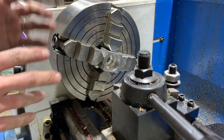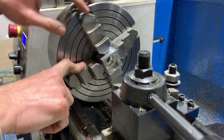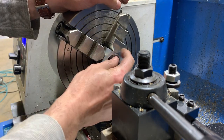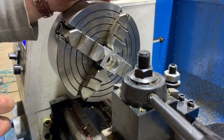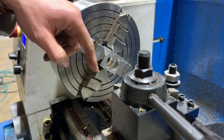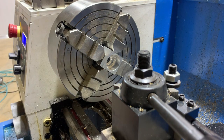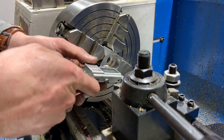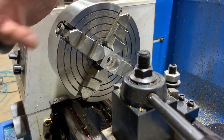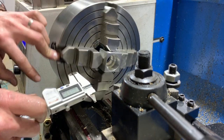So you probably just saw me do a bunch of futzing around trying to get this thing dialed into center. I was drilling in and sort of taking measurements and checking that the sides were the same, and they weren't, and I was sort of chalking it up to measurement error. Of course, I was measuring upside down with calipers, and yeah, there's some feel to it, but if you can't see the numbers, you can't get a sense of whether you've got this at the right angle. So I turned the camera off, moved everything away, and took measurements, and got everything much tighter.